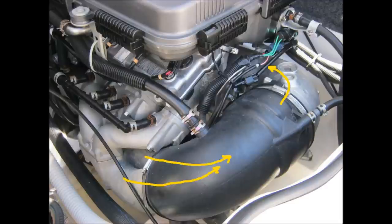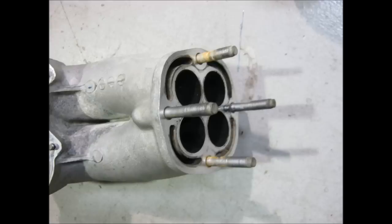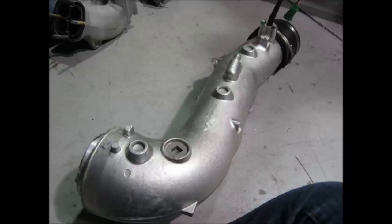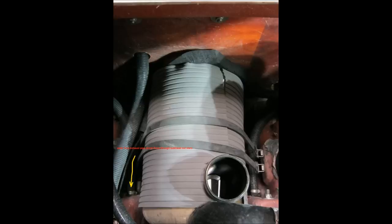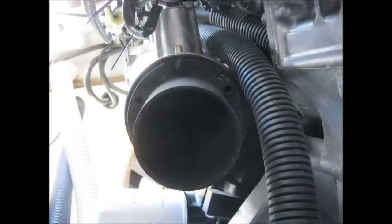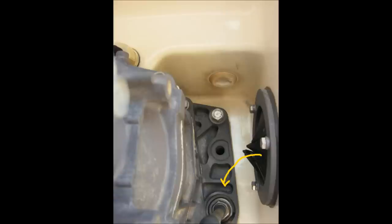The majority of water is pumped into the lower exhaust manifold where it flows through the jackets. The water flows on the outside of the exhaust under the rubber boot and then returns to flowing inside a jacket in the exhaust pipe. It leaves the exhaust pipe one of two ways: one is the outlet on top of the exhaust pipe which goes through a hose through the bulkhead and eventually out the transom. The other is through three holes that dump directly into the exhaust gas — this is the first place the water and gases actually touch one another. The exhaust and water then flow to the water lock located under the swim platform and eventually out the through-hull fitting.